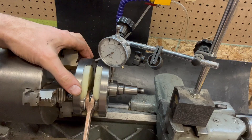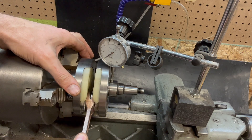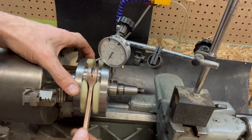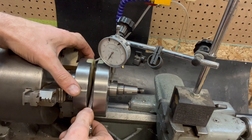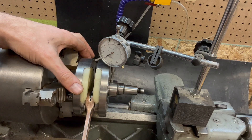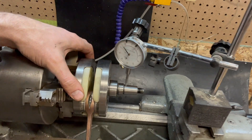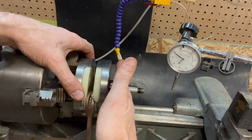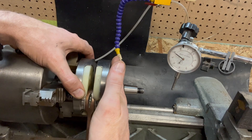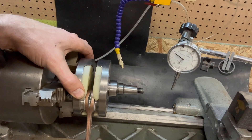This part here is the tough part. It definitely takes a lot of experience to have the feel — to know how hard to hit it, where to hit it, and even how to measure it properly. This bearing has a fair bit of play, so it's not just rotate it here and rotate it there and check the numbers. You've got to make sure that everything is settled, and there's just no way around it. This is something that takes quite a bit of experience. To get competent at doing cranks, you're looking at doing a few dozen. I've seen lots of guys do a good job on their first attempt, it just takes them several hours. After doing hundreds of cranks, sometimes I can do them in about half an hour and sometimes it takes me three hours.